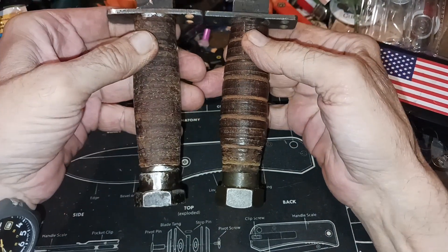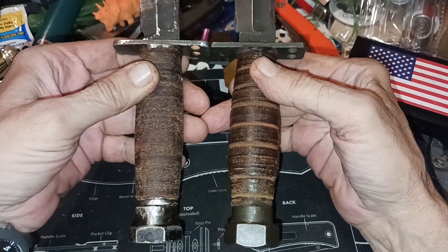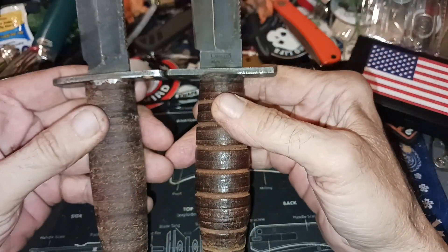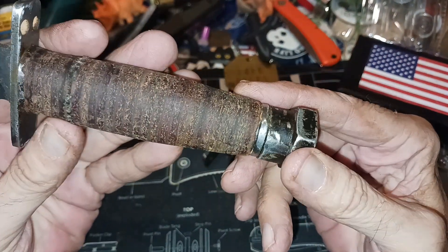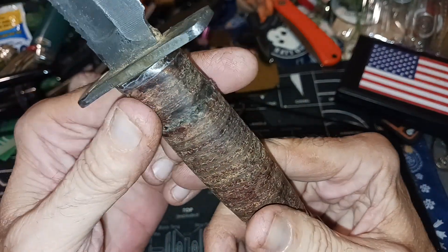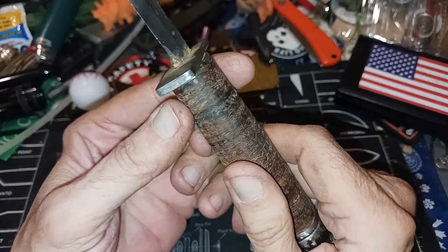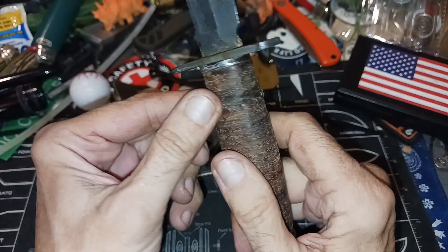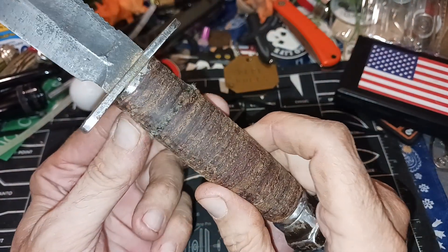Something I noticed — mine is just a little bit shorter in the handle, because I had to peen it twice. I didn't put any finger grooves in. I double lapped this: instead of a one lap, I put it around twice, and I just had to be careful of the rotation of the grinding when I did it.